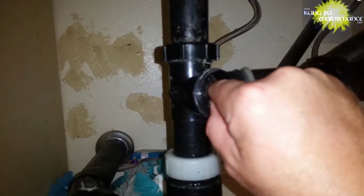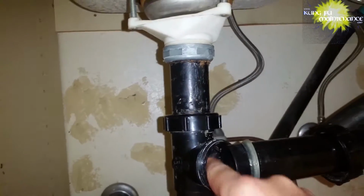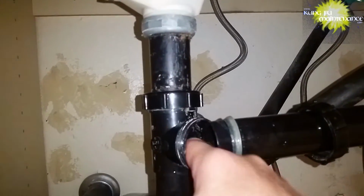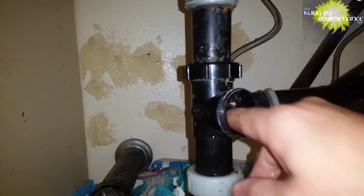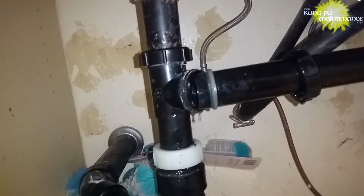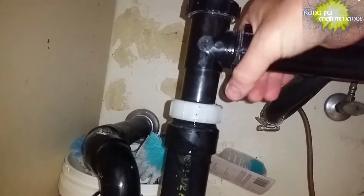Well, had a clogged kitchen sink drain here, and this is where these most often clog up, is at the T. It actually gets a bit smaller at that point, and it's usually potato peels and carrots that have a tougher material. It's harder for them to pass this point. But it also happens with rice or anything that anyone feeds the monster too quickly. Sometimes you get away with a little bit of stuff if it's done really slowly, but that being said, it's better to just throw certain things away.